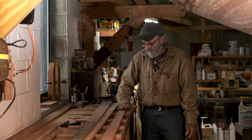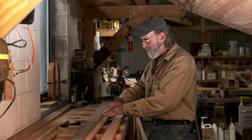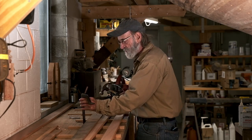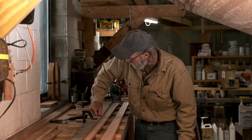There are a number of things that have to be right. This is a light batten — it's very easy to force down against the bench just with the weight of the saw. The batten's got a little bit of a curve and a little twist, but when you put the saw on it, it forces it right down against the sleepers on the bench. Now, the plank and the batten tacked on top of it are not laying perfectly flat either — the plank has got a little bit of roll or twist. We're going to be cutting planks within a quarter of a degree or half a degree, so it's got to be perfect. We're going to take a bench dog, and we're going to have a series of these all the way down the length of this plank. You put it in a hole in the bench, whack it with a hammer, and it holds the plank right down perfectly tight.